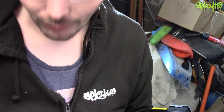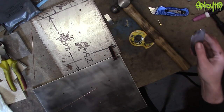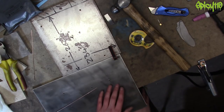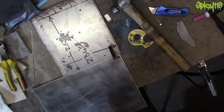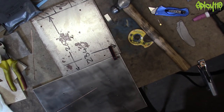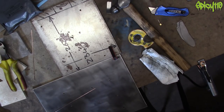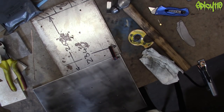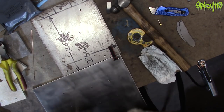My major concern right now is how I'm going to weld these. I'm going to clean these up, round the edges off, then cut out another piece and try to weld it onto something to see if I can get it to not blow apart. The wings are roughed out, I've softened the edges a bit. I've got this plate to use as a welding plate - wire wheeled it, cleaned off the grease. I've cut out a little tab for earthing so I can connect the earth onto it. I'm going to try to TIG weld it - I'd normally MIG weld that because it's so thick, but I want to try. I'm using 2.4 mil tungsten, trying 90 amps, using a bit of filler as well.